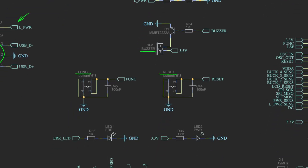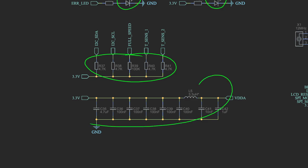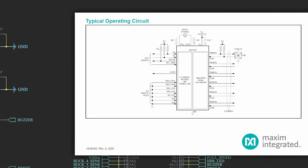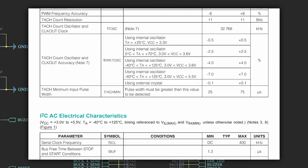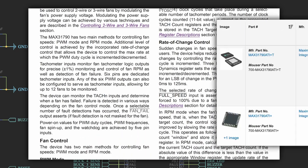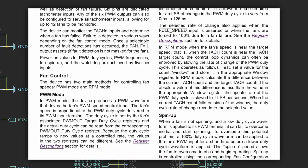Next: buzzer, buttons, LEDs, pull-up resistors, filter capacitors, and an inductor on the MCU's analog power supply — I didn't calculate it, just used the smallest one I had on hand. Then there's the interesting fan controller chip from Maxim. It's a very capable device, but now having gone through writing the firmware, I can't say that for this specific design the benefits outweigh the drawbacks. The chip has downsides, starting with its price. I planned to do a review of it, but I'm not sure it would interest anyone.